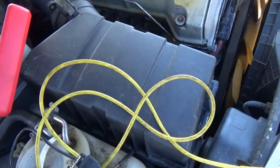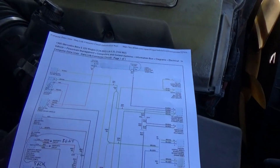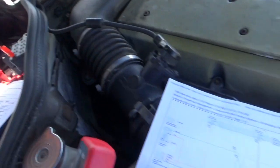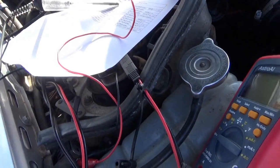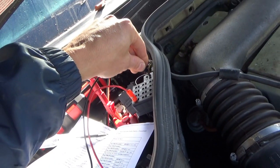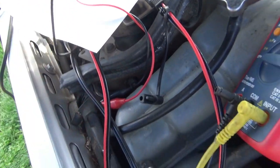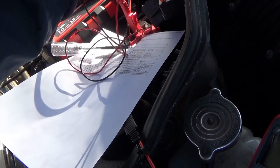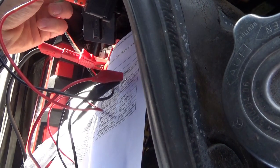Let's set up the tool the same way as the pulser and try it on pin 3 first. We want power going to our LED. If it finds a ground the LED should light up — yes it does. Going from pin 16 to 1, LED lights up — that's a good test. Keep in mind the positive and negative do matter on a diode. Now let's plug the LED into pin 3 — it's not lit, but if we push the button, yes it lights up.